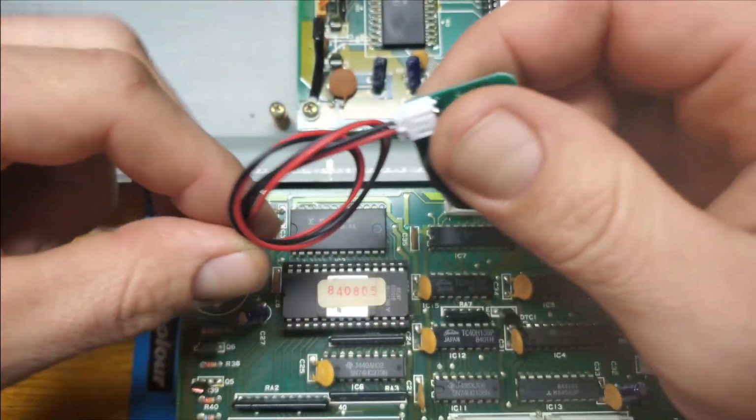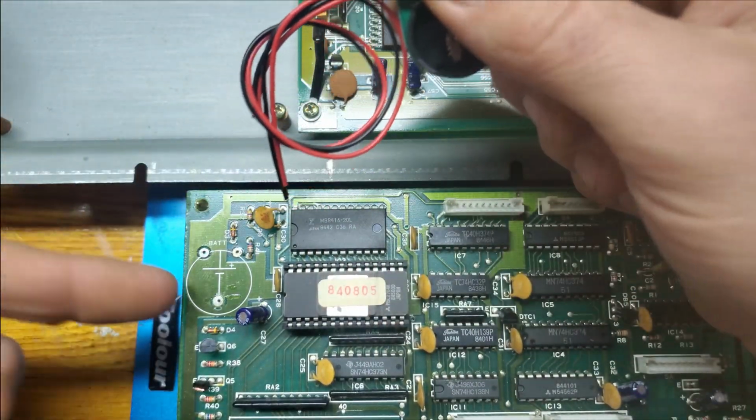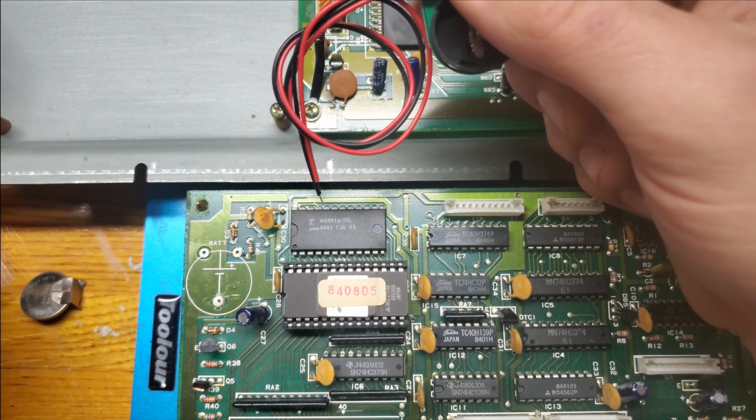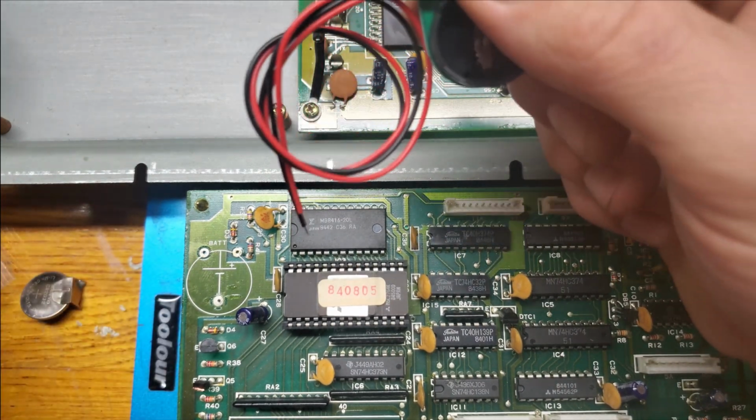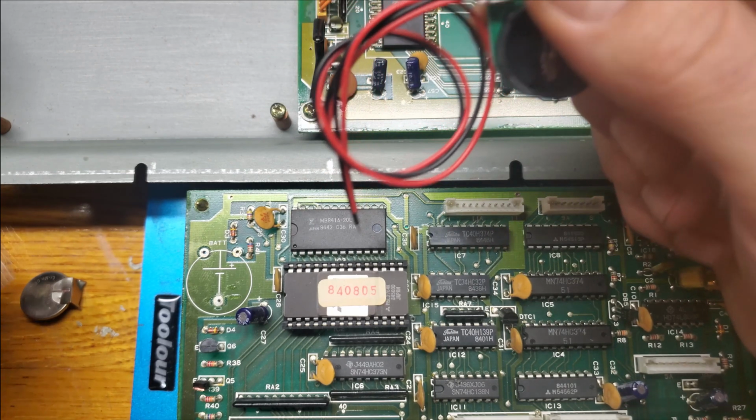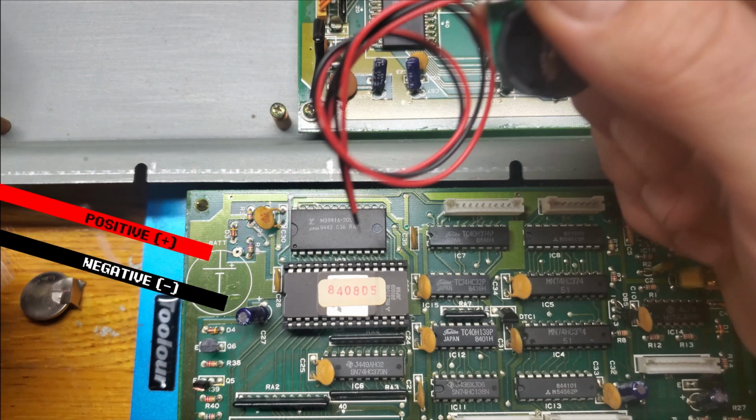The board is labeled, which tells us which vias are for positive and negative. You may be asking, we have 3 holes here, and we have 2 wires. What do we do about that? Don't worry, 2 wires is all we need. On the top, we have 2 vias for the positive lead. You can use either one. This is because they are essentially the same node. Simply put, they are connected to the same thing with no other connections made between them. The black wire is used for the negative connection, and the red one is for our positive connection.